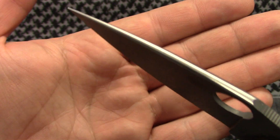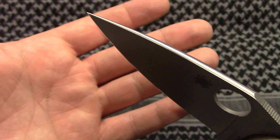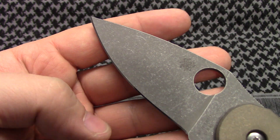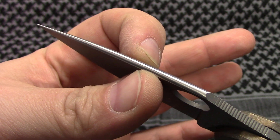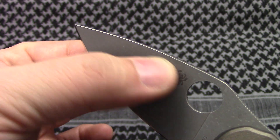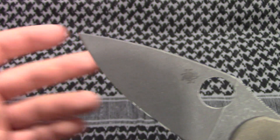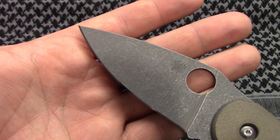I rounded and polished the spine, but I didn't polish it to a real high sheen. A lot of people have been asking me to polish this and that — I'm not a polished person. I do the edges polished with the Wicked Edge, and this is just at maybe 500 or 600 grit, but it hasn't been buffed, because if I do that I'll hit the edges of where the acid is and it would screw up the look of the acid wash. So just so you guys know, I'm not a big polished person — hand rubbing and all that is not my style.